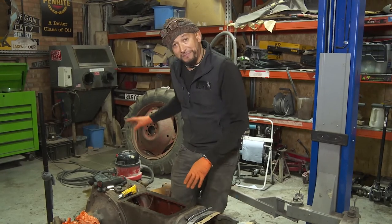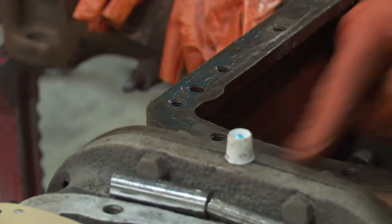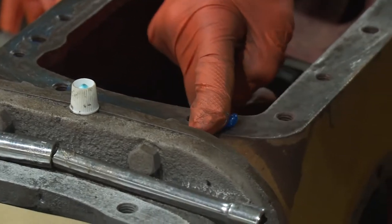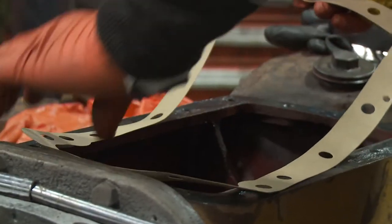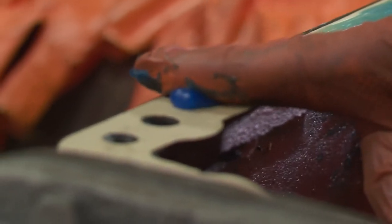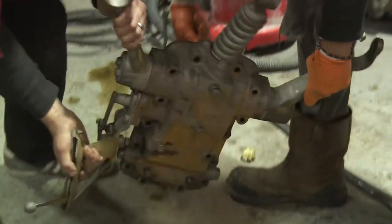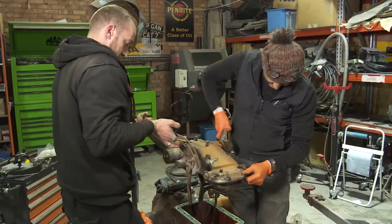If we know that the hydraulic piston side of the gear is all working, let's get it back together. On with a bit of gasket sealant — a nice thin smear, because we don't want our gasket to get spread out by that and split, which can happen if you put a little too much sealant on. Okay, let's lift this on — carefully down.